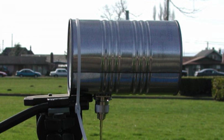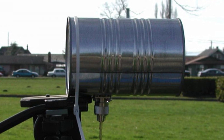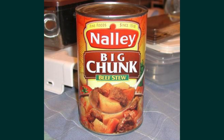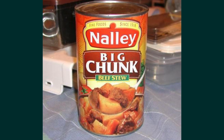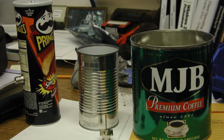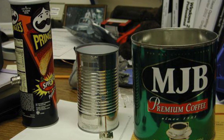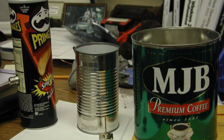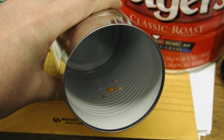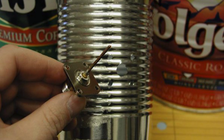Second, the can should be between three inches and three and two-thirds inches in diameter. The size of the can doesn't have to be exact — a soup can or a can of stew can work. Once you have the can, you will need to drill or punch holes in your tin can to mount the probe. The N-connector assembly will mount in the side of your tin can, and the placement of the hole is very important. For a tin can with a 3.25-inch diameter, measure up 2.49 inches from the bottom metal end of the can to put the center of the hole. Open only one end of your tin can, heat the contents and give it a good washing, and remove the label. Use a ruler to measure up from the closed end and mark the can with a dot.